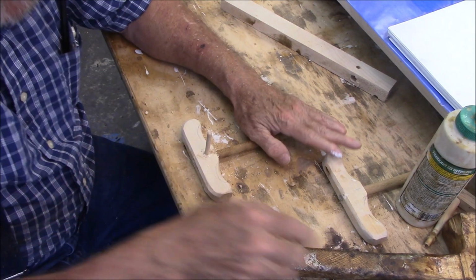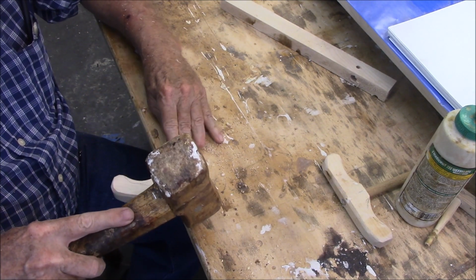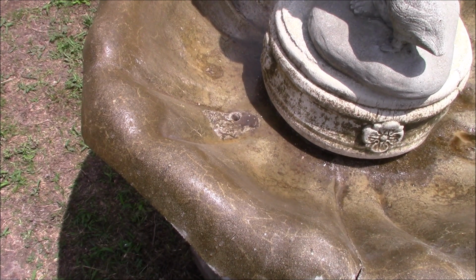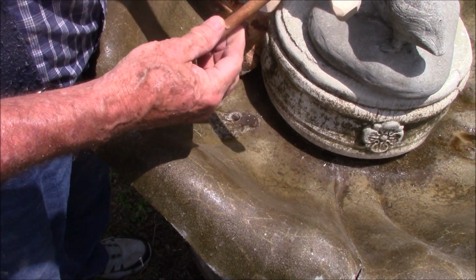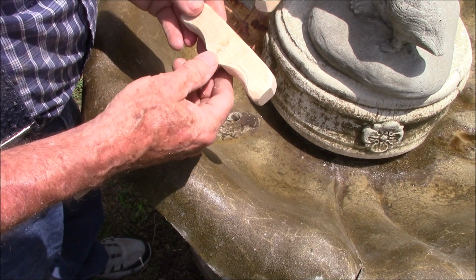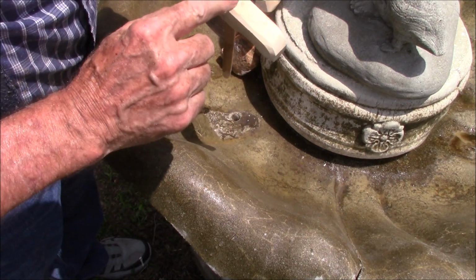Okay, I'm putting that cross dowel in now. All right, here are our new plugs. They got the red oak, which will swell into the hole. This is hard maple. Got a beech dowel that goes through the oak, and the main plug here goes all the way through the hard maple. Comes out over here.